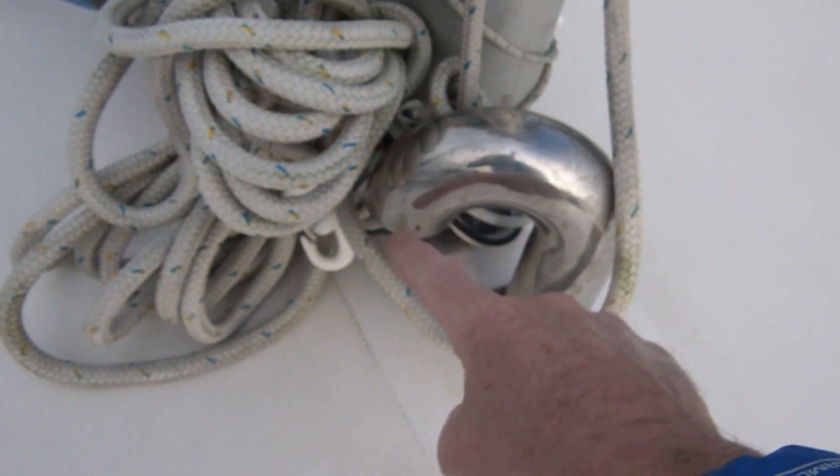This second space on the deck in front of the mast has one big advantage — that stainless steel swan neck there, which is a gland where wires come in and out. The wires just go straight up and into the boat from there. No drilling, no messing. So let's measure this area and see if we can find a panel that might fit. The advantage here is we don't have a width restriction, just a length restriction — but it'd be nice if it was no wider than the hatches. Armed with this information, let's move on to step three.